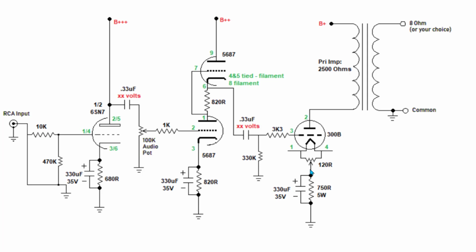And what's really going on here is that this cathode capacitor bypassing this resistor gets rid of something called cathode negative degeneration. In other words, it's a form of negative feedback, and canceling it out would otherwise cause a massive reduction in gain. And that's what we were seeing. We basically didn't have this capacitor in play at all on our circuit.